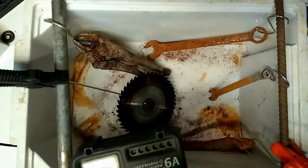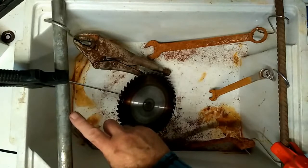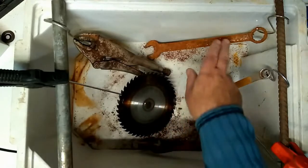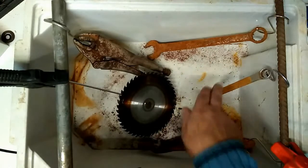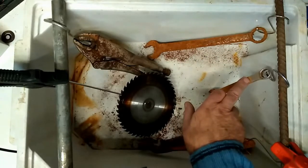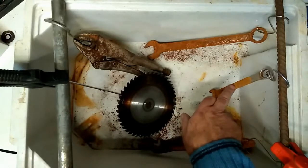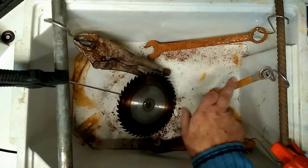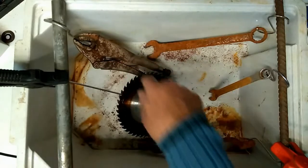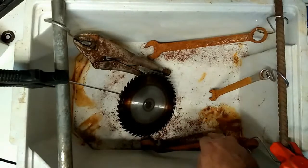A gentle trickle will cause electrons to migrate from the cathode across to the sacrificial anodes. Of course sacrificial - you can see how rusty they are. Here is the previous water level, so below that was wet and attracted rust, above it was out of the water and didn't. So you can see how it pulls loose rust from these items.